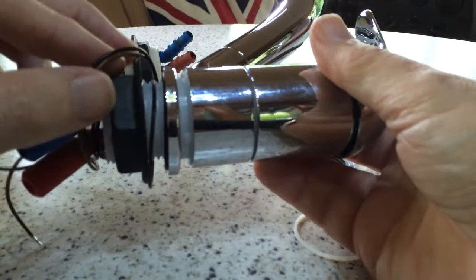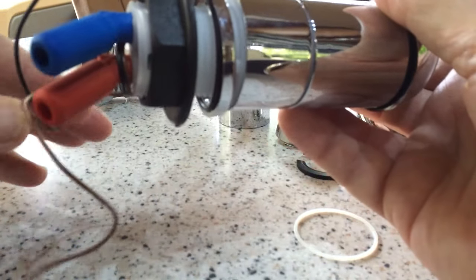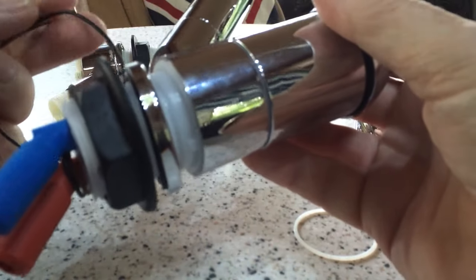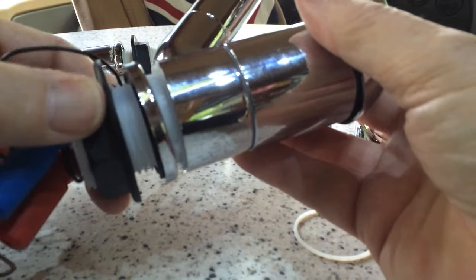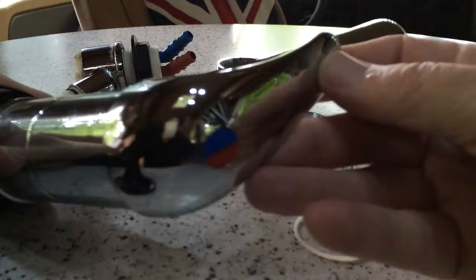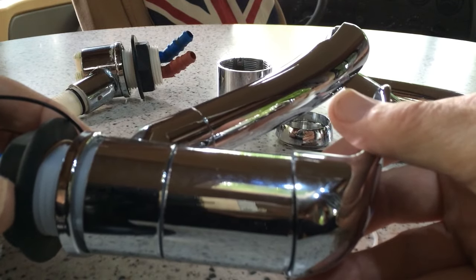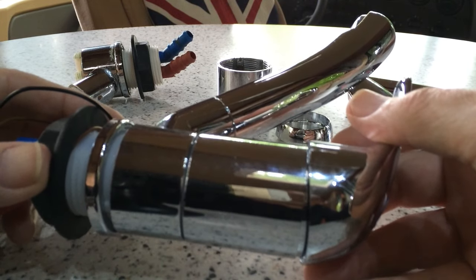You'll find the tap comes with some wiring — that's for microswitch taps. If your taps have a microswitch, connect these up the same as your old ones were. If your taps are on a pressure-fed system like mine, just ignore the wiring and either cut it off or leave it under the worktop out of the way. It's an easy DIY job, great when it's fixed because you don't get any more puddles on your worktop — so long as you can get to the bottom of the tap. Some are in easy positions and some are really awkward. I hope that's been of help, and there'll be more details on the Club Motorhome website.